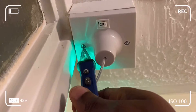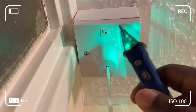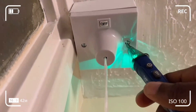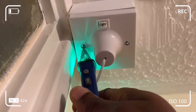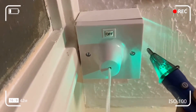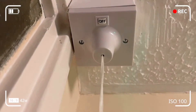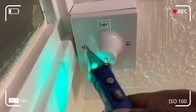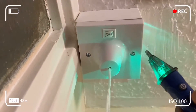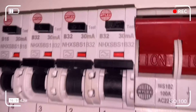The pull cord switch is switched off and isolated from the fuse box. If I pick up any false positive it would be worrying, but remember a false positive is always better than a false negative — you don't want to touch a wire when there is live voltage in there.